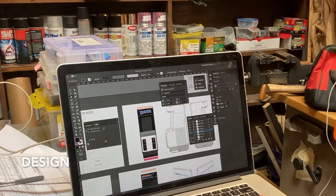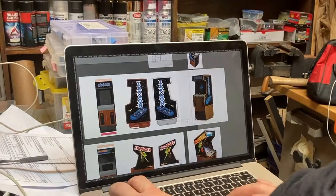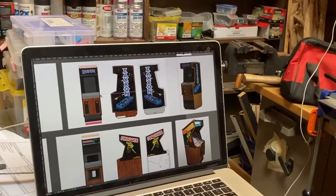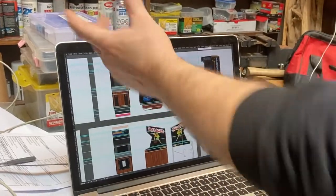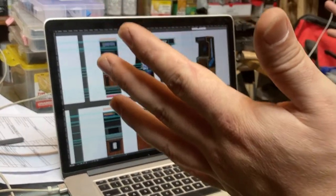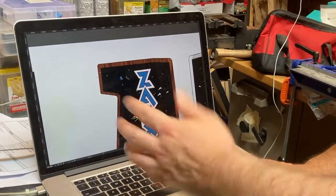So I start, and I do it in 2D views like that. Does Illustrator actually give you dimensions and all that? Yeah, it's totally accurate dimension-wise here. These are my references over here. Now you recreated that profile first, the front elevation on the left. I just did that by carrying points through over here and setting my widths to what I want them to be. So between this view and this view, I can calculate what any piece is going to be. The good part is that I can just do my artwork right on top of it, and then it's all ready to go.